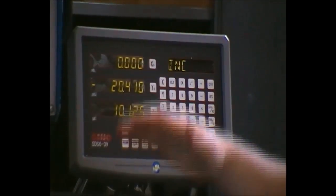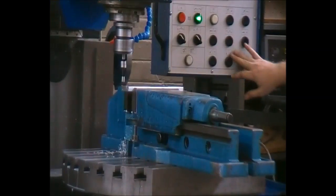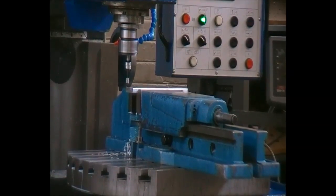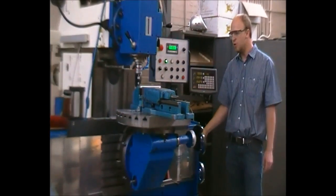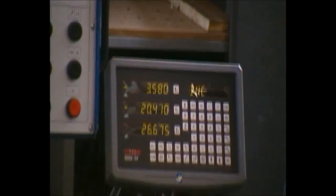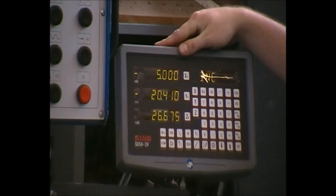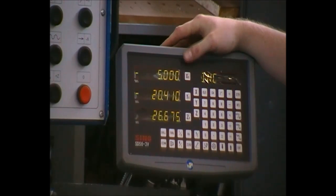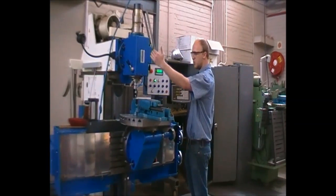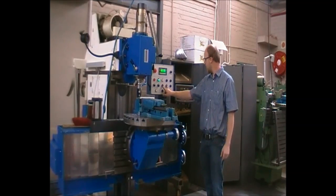We then move down in the Z-direction and move manually. As the diameter of the wobbler is 10 millimeters, we now move 5 millimeters which will show us the centre of the spindle. Five millimeters now indicates our new zero — this means the spindle centre is on the edge of the part. The same can be done for the other side.